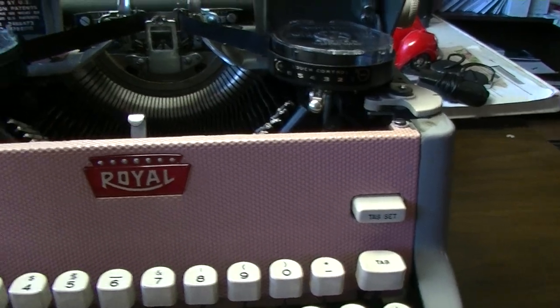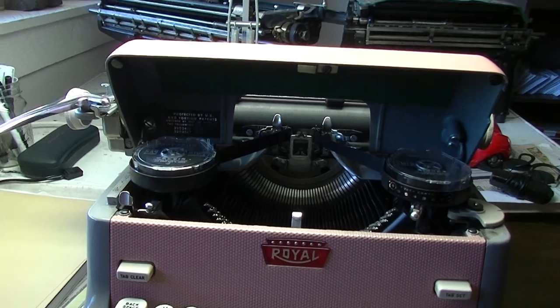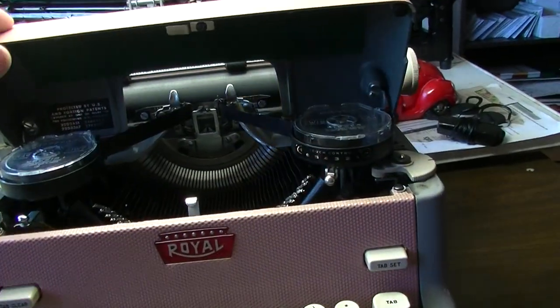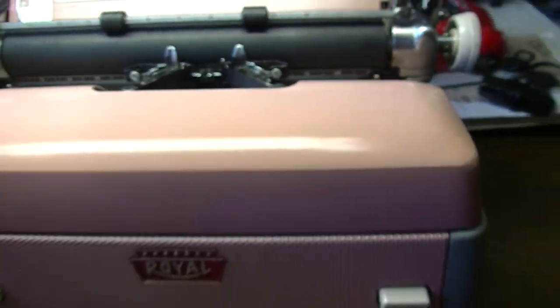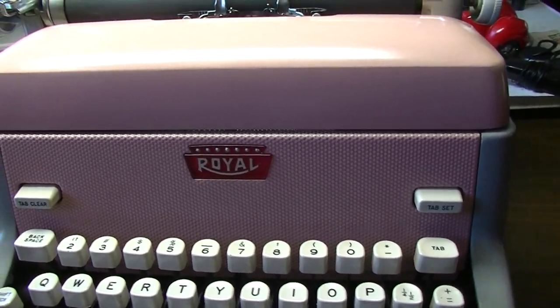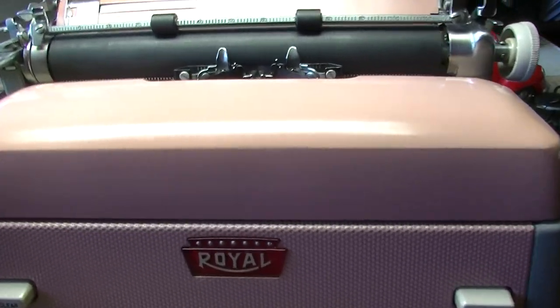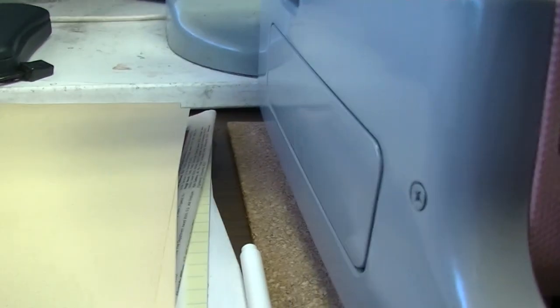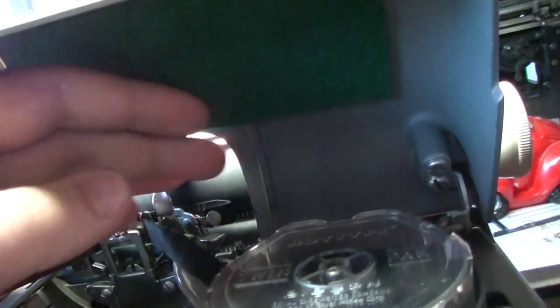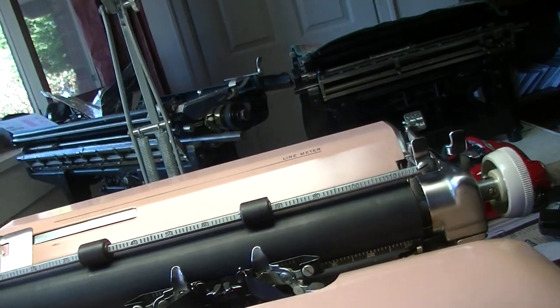The foam padding in this machine — quite common with old typewriters — was still intact but upon touch it would just disintegrate and turn to dust. I cleaned that up when I was fixing the tabulator. I went to a sewing store and bought some velvet, which I put on the inside of the back panel, the lower back panel, the front panel, and both side panels using hot glue. It actually works — it dampens the sound quite well, better than without it. It's soft velvet but very strong. That was a good decision, especially since I want to use this machine regularly.